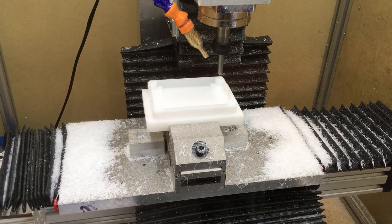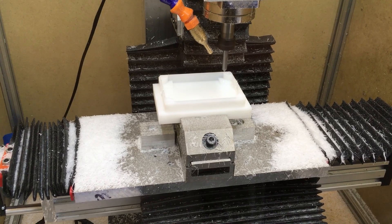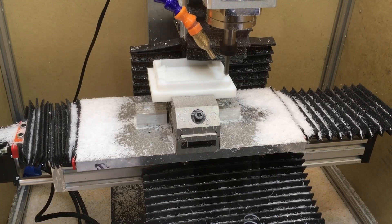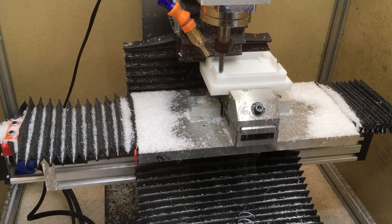Then I did some spotting and then drilling. Normally I don't drill with the mill, but because my spindle is kind of a router spindle it turns a little too fast usually for most materials. But in plastic it seems to do fine, as long as I clear it from time to time.